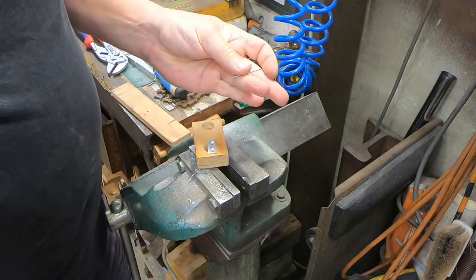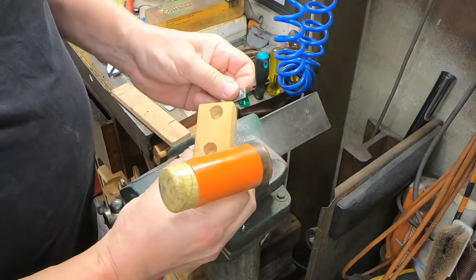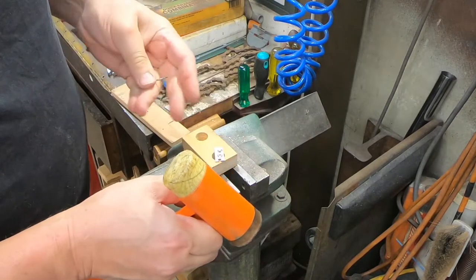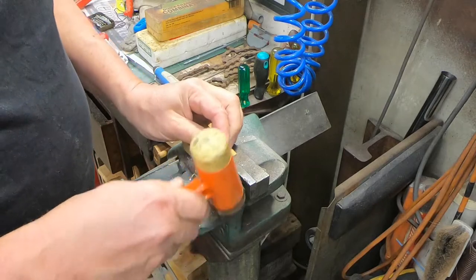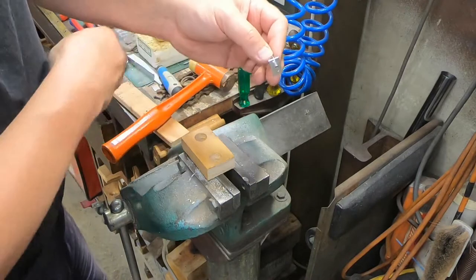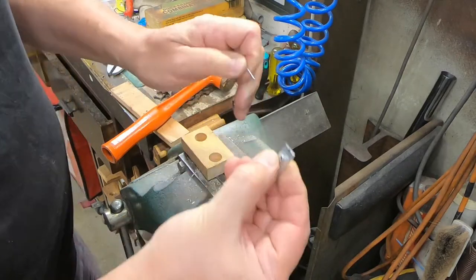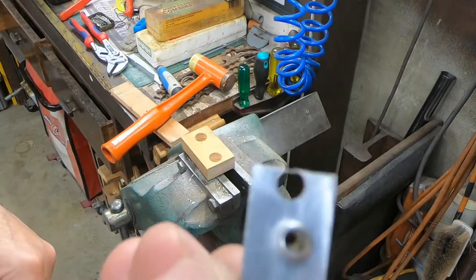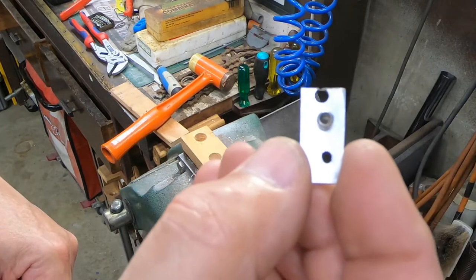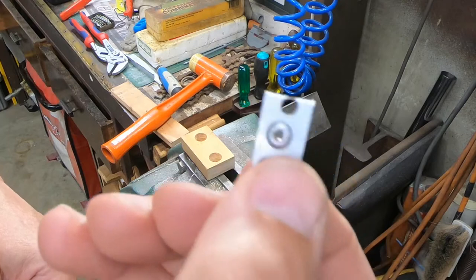So, using the discarded shank, you put that in there. Now, I'll do this into this little pocket so it will catch the bit that comes out. Doesn't take much to knock it out, but you can see now that it's hollow all the way through, and you might perhaps be able to see right through the rivet now. You can maybe just see through.